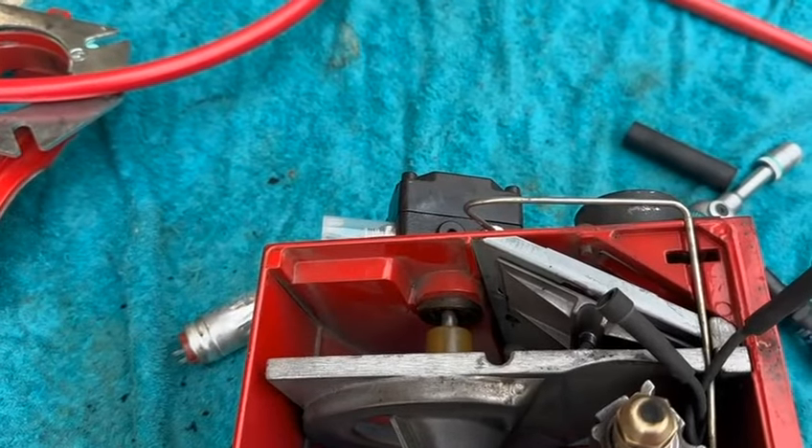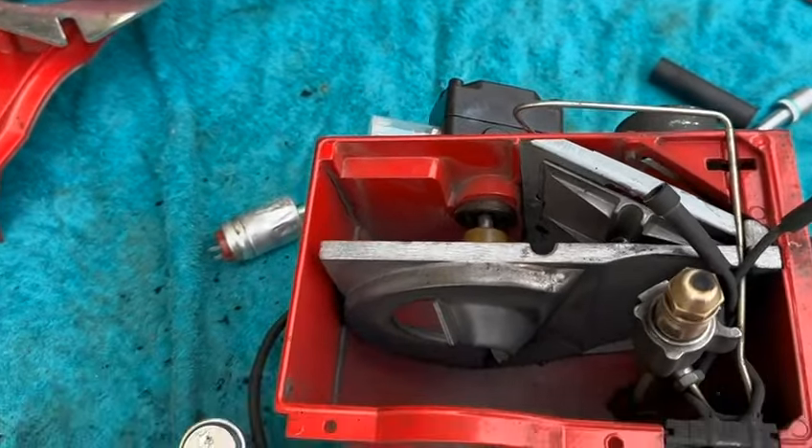I'm not going to remove the pump — I'll look down there, pull the coupling off, check for leaks, and turn it 52 times in the direction of the pump. It's an L3 pump, which means it turns left when viewed from this side. I'll check for tight spots and that's done. I've also checked the transformer — no bubbles, just a bit of dirt, and all the leads are lovely and flexible. I've put a new nozzle in — jumping forward a bit as it's nearly quarter to eight and I've got a job at eight.